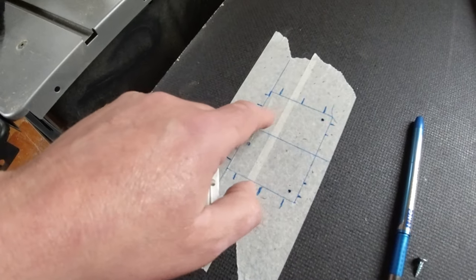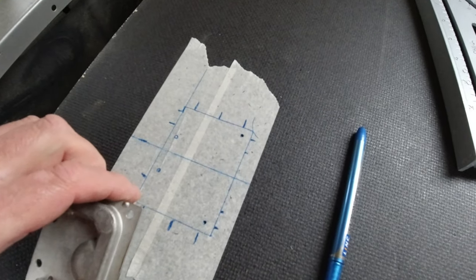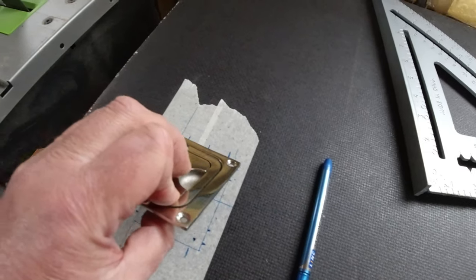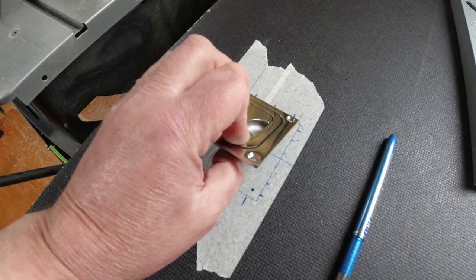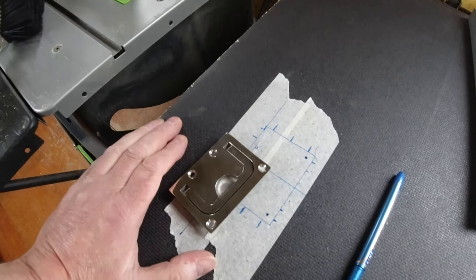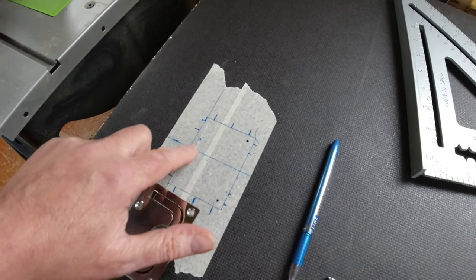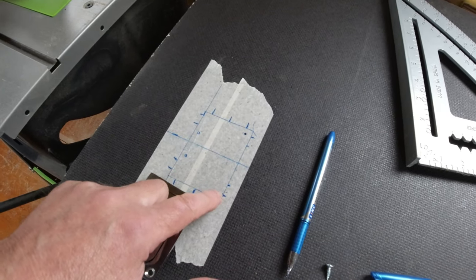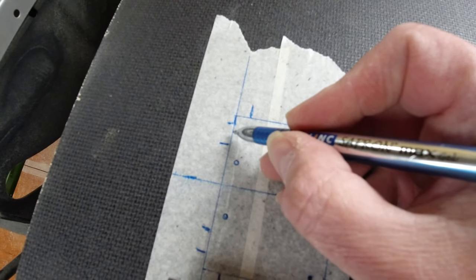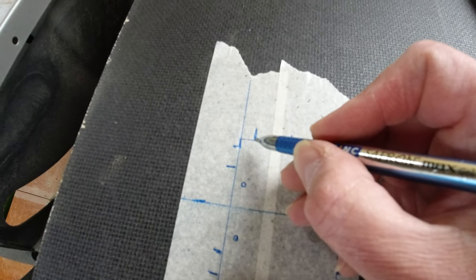So what I'm doing now is just punching out where these screws are going to go, and I'm going to put some screws in temporarily. Then I'm going to mark out where I need to route out so this drops in. I'm going to dry fit it - I might even screw it in so I can get this board on top of the engine bay, and then I'll remove them again. Then cut out either with a router - I'll probably do it with a router - or a chisel. I'll certainly need to do the edges with a chisel because the router is going to leave a little bit of wood on the edge that I need to cut out.